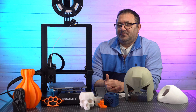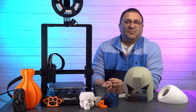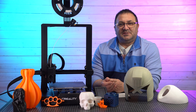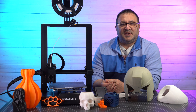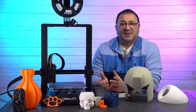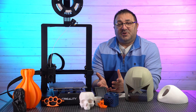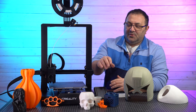And if you need to slow it down to get an even better looking print, do that. I'm printing a helmet right now on another printer — the K1 Max — and I've slowed it down to 200 or 100 millimeters a second. It's going to take two days instead of maybe a day, but I'm getting a cleaner line and I'm not in a hurry with that project. So you could always slow your prints down. Really, really happy.